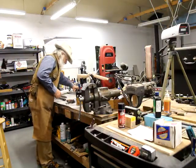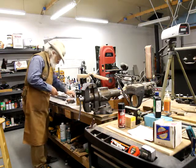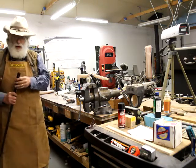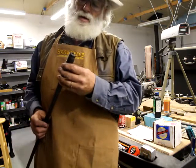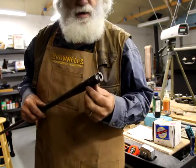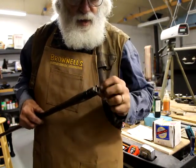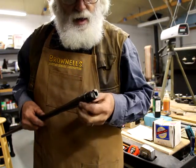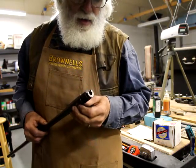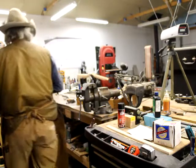We have our bit to cut our stub — I made another stub. The only other thing that has to be cut on here — on the last couple I did, I cut it by hand. This one looks like it was just ground by hand too. We'll have to cut this little half circle that's in there — that's where the rolling block hits or clears. And this little groove right here is where the extractor fits into. I usually do those by hand: just measure them out, and once I get the barrel set I can mark it and grind those out.